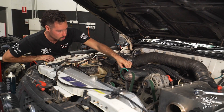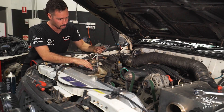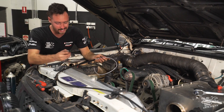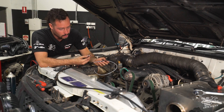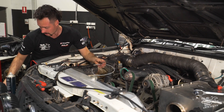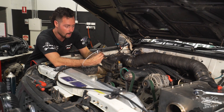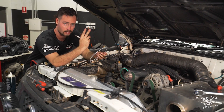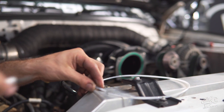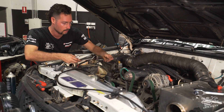I've just put the jet in - there was a longer one and a shorter one supplied, and the shorter one looks like it'll work better in this situation. Now I need to hook up this outlet hose which comes from the meter. There's a one-way valve to chuck in as well - I'll put that close to the jet to avoid anything running back through the system. Keep in mind with push fittings you want a really flush circular edge. It's better to use a Stanley knife to get a straight flush cut to avoid anything turning oval shape - you want to keep it very circular.